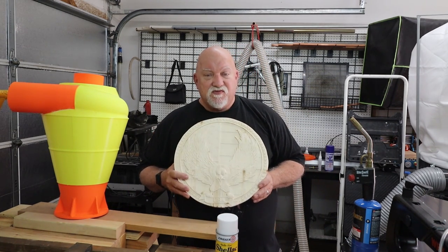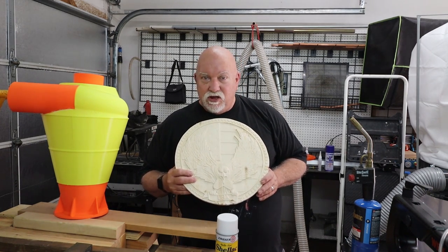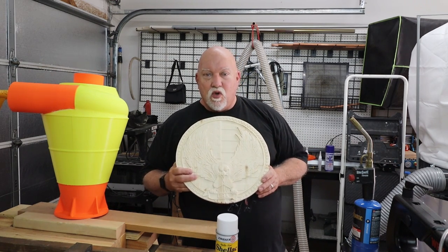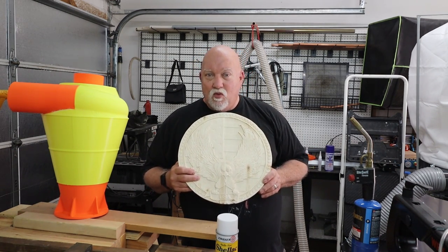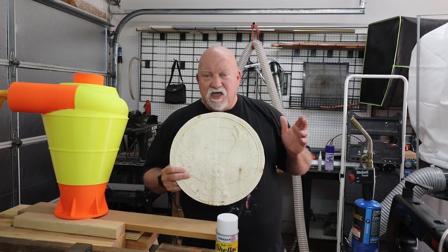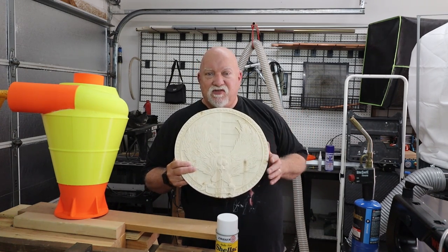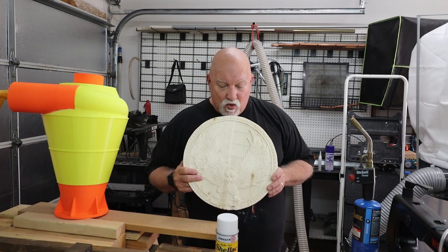And as far as the speed on the Makita router, when I turned it on, I kind of went by ear. You know, I've used a lot of power tools my whole life, and I kind of went by ear with how fast I should run it. Whether that will work for me in the future or not, time will tell, but I went with hearing how it was running. It's got like 1 to 5 power settings, and they're like 10,000 up to 30,000 RPM. I'll just have to fine tune that, do some more work to get that right.